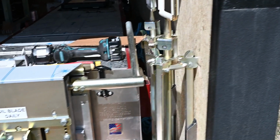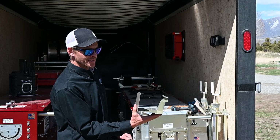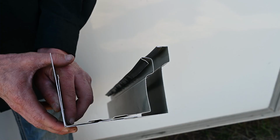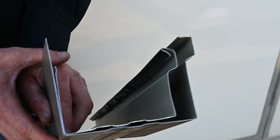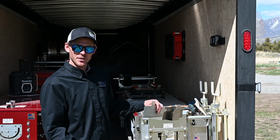So this is also new for us this year. This is a combo machine, so it runs out 6-inch box and 5-inch box. They both use Raytech hangers, which is nice. They both sit flat on the fascia. You just hang them pretty much like a normal gutter.